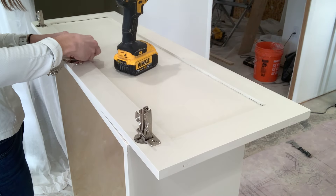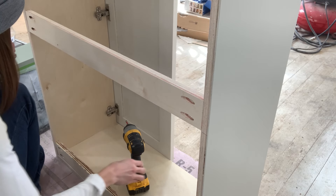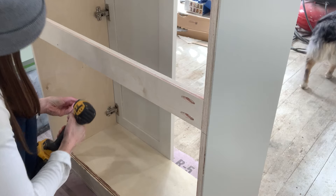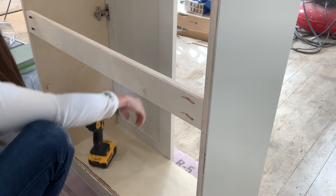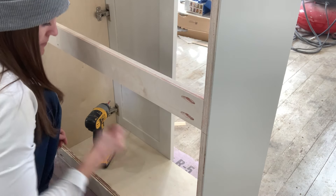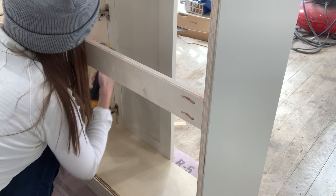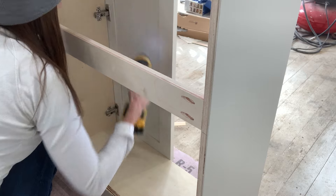Then I went ahead and mounted my hinges to my door to get ready to attach them. I find the easiest way to line up the hinges for the doors and cabinet bodies is to just attach them from the inside with the door closed. But I understand sometimes you can't do this, especially if you've already built a back onto your cabinet. I saw a video on YouTube where instead of installing the door from the inside, they made a template the full height of the door but only a couple inches deep, attached their hinges, slid the front part of the hinge off, attached it to the actual door, and slid it in — a great option if you can't get from the backside.